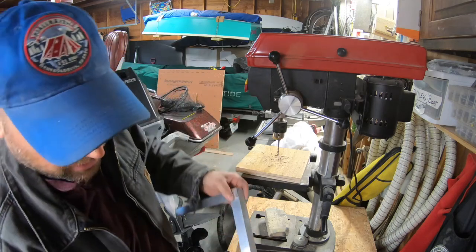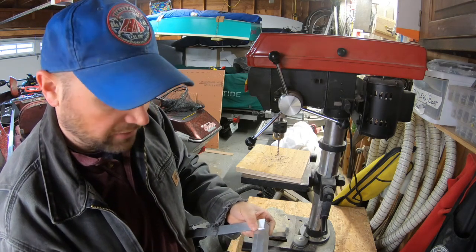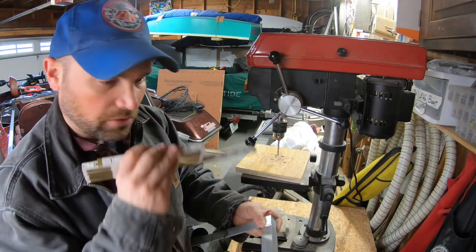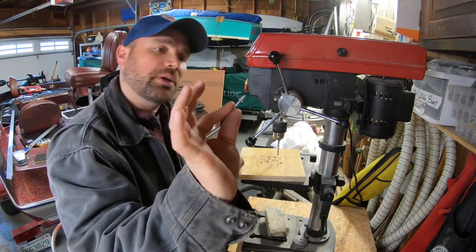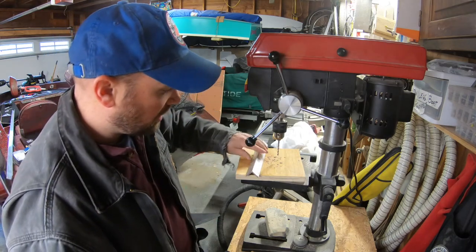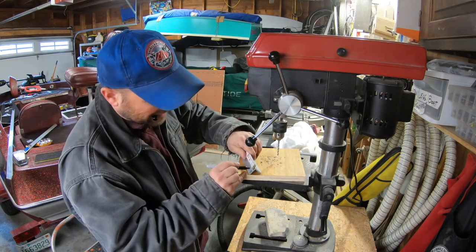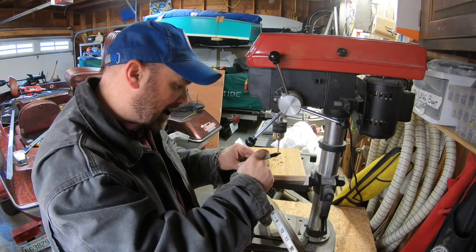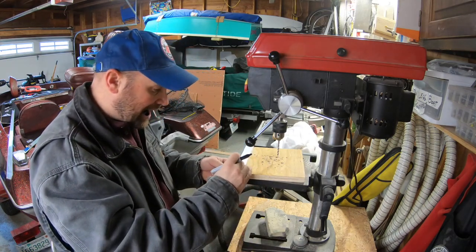What I'm trying to figure out is, this is 1 inch thick, so if I put a rivet 1/2 inch in, in a square on the top of these, that should start me where I want to be for the cross brace. So I'm just using my drill press, with a 3/16 bit to go with the rivet. I'm just going to mark the square end here and make a hole. Somewhere around there, 1/2 inch, 1/2 inch. Okay, I got that right.